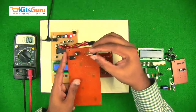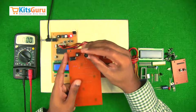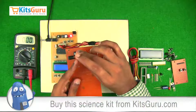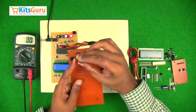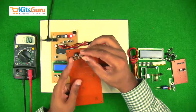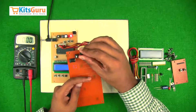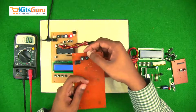If you supply power through a transformer, you need to convert AC to DC — that's what the bridge rectifier does. Looking at the bridge rectifier from the top, it has four terminals: two input terminals for AC signal and two output terminals marked with positive and negative signs for DC output. The stem which is longest corresponds to the positive terminal, so while inserting, ensure the positive terminal is at the top right.